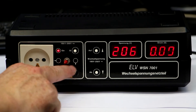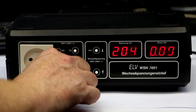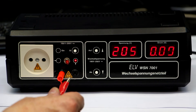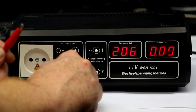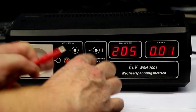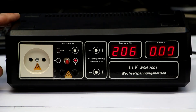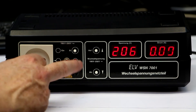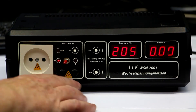The first nice feature is setting the voltage in 10 volt steps, and the second is having two switchable outputs. Now I will show you something you should not show to your kids — a demonstration of what an isolation transformer is good for. You know that if you touch one of the mains wires there is a 50% chance you get bitten, when you touch the live wire. But here, this doesn't happen — not at this output and not at the other one. You only shouldn't touch both at the same time. So you are perfectly isolated, and the ground fault protection also cannot trip when doing repair work and accidentally touching any device connected to the live wire.